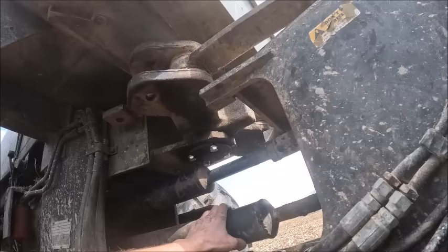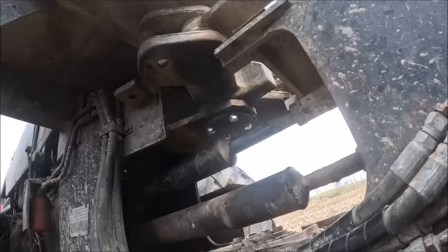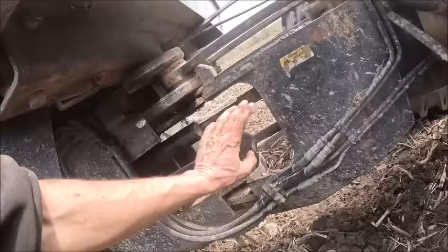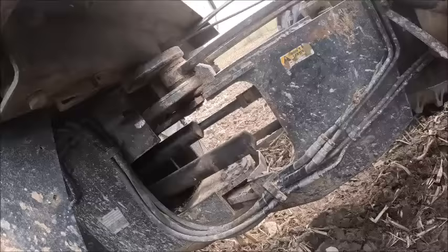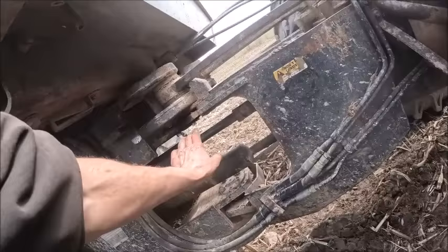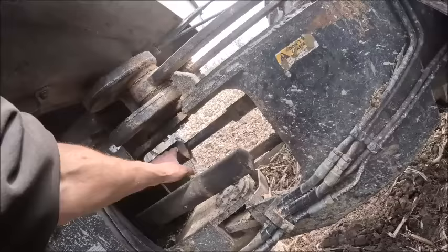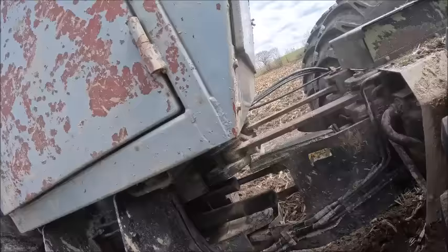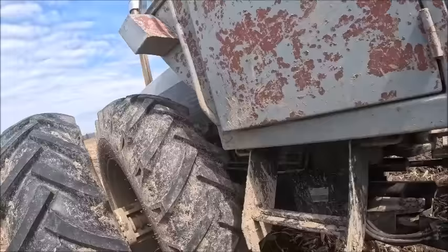Like I say, there's a drive shaft shop down in South Bend called Action Machine that should be able to fix my shaft, because other than busting the tube, it didn't mangle anything else up, luckily. So if they can fix my shaft, get a 210 shaft put back in the top, find a 210 shaft for the bottom to have four 210 shafts, top and bottom, so they're the heavier shafts with heavier universals. And then it won't be a this-spring project, because we're running out of this spring. But get a new pin for up here and get bushings and everything to rebuild the steering knuckle, and make all that right again. The bottom seems to be tight, but the bottom doesn't see near the stress that the top sees. So that's kind of the plan.